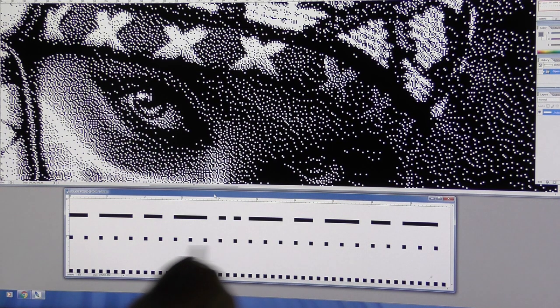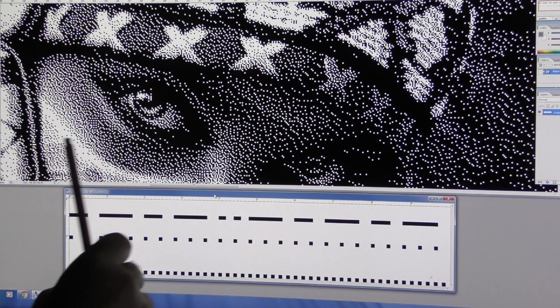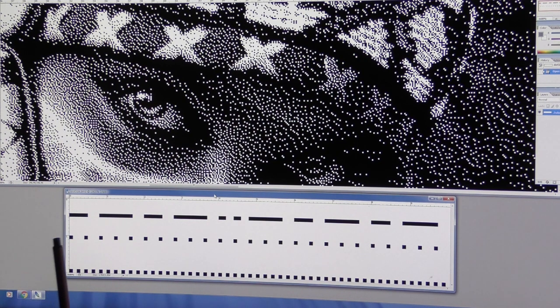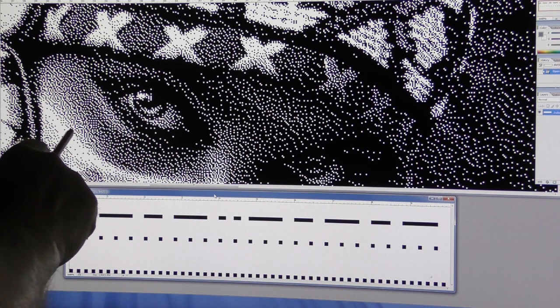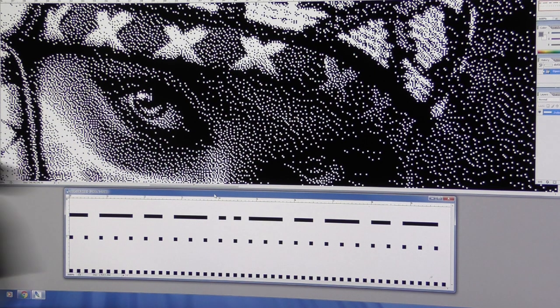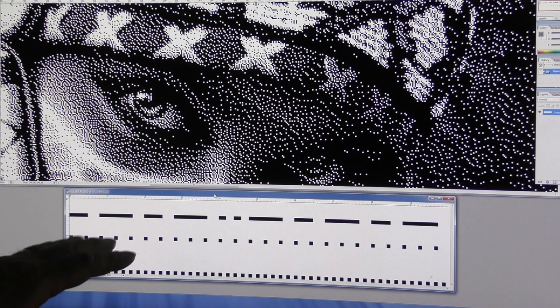The picture is stored in memory and software scans backwards and forwards, reading these dots like Morse code. Here we've got a line of about 4 or 5 pixels, then a gap of 2, then a single pixel, gap of 2, single pixel. And here we've got black pixel, white pixel, black pixel, white pixel. This 254 ppi alternating pattern is what I use for calibrating and setting my machine. If you can reproduce this pattern cleanly and clearly, you have the capability of copying these individual pixels - which are 0.1mm. Photo replication is an exact copy of these pixels.